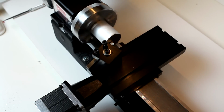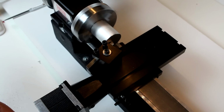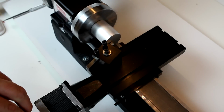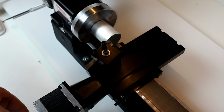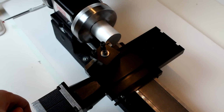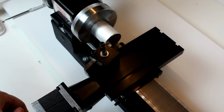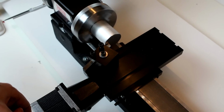And then we're going to move the Z-axis back in. Again, very, very light, since we're just learning how the machine feels and how to do these cuts. So this is another 5/1000ths in. We'll probably get a little more contact on the edge. That knocking sound we heard before means we have an interrupted cut, so we're not cutting all the way around the piece yet.